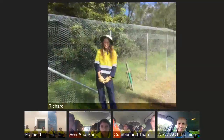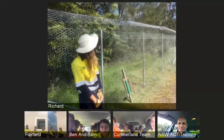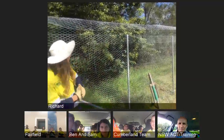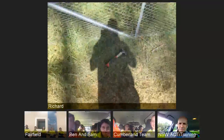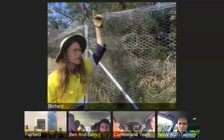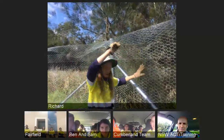Hi, I'm Jasper and I'm going to talk to you guys about the design of the fence. We're building a strainer post and star picket fence. We're using 40mm netting. We're also attaching floppy tops and foot skirts to prevent burrowing and climbing over the fence. These floppy tops come out 450mm just to stop any climbing.